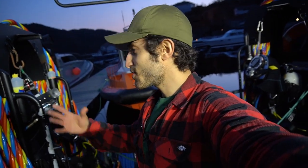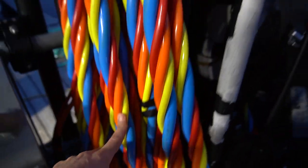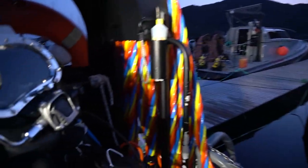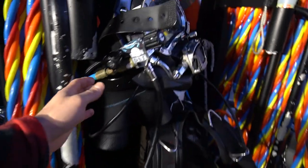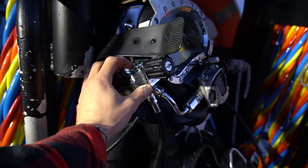Okay, hi guys, I hope you enjoyed that little introduction. I've just got back on the surface and I thought I would show you a mini introduction — without getting too complicated — of the equipment and also a mini tour of the boat. As you can tell we have different pipes coming into what we call the umbilical. The umbilical is about 120 meters long; it's always longer on the standby should there be a rescue. The main function of this system is to feed a very large supply of air going through the mask, to the block, to the diver.